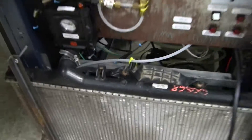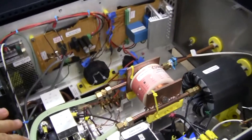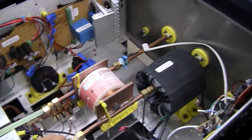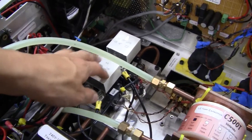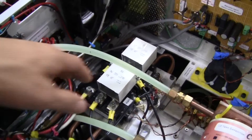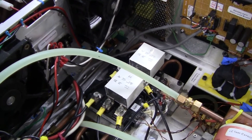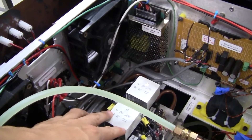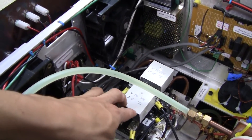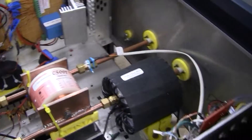Finally on the back here we've got the radiator, which is water-cooling the coil. You can see these lines coming in over the copper tubing, and it also cools the IGBT bricks right here. These are 400-amp IGBT bricks rated for 650 volts. On top of them are snubber capacitors, which provide the high-current surges needed to switch this coil.